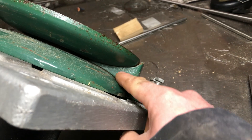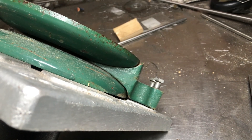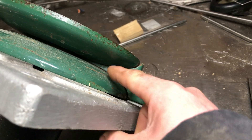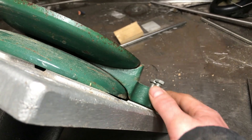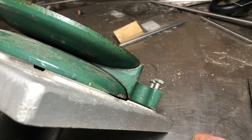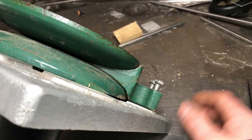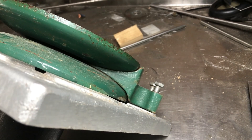This knife actually fits quite tight — I did whittle it down myself with a flapper disc to get it that tight — but it still won't work with long lines. If you get a hook in there it'll jam it solid and you just can't get it out without unbolting the knife. The floating knife will just flick out of the way, clear it, and start off again. You'd only be playing around with spanners at sea, and that's just too much effort.